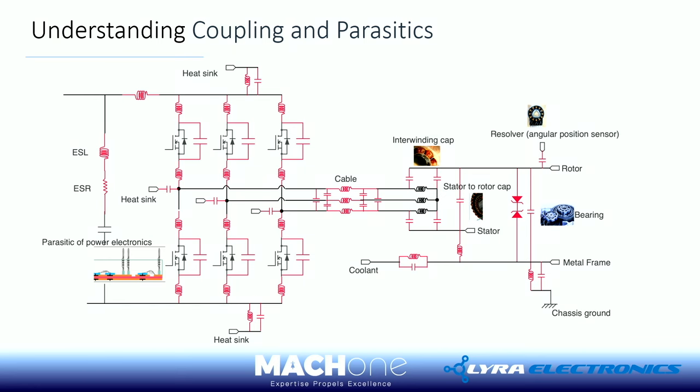However, as you said, if your chassis ground is bonded to a dirty or clean ground, whereas your motor drive is via heatsink bonded to another ground, and remember the conversation we had between these two grounds, you could have a gap or break or whatever in between. That's a high impedance path. So all of a sudden, you create a big loop with lots of noise there, and chances are the system will radiate a lot. And also, think about this dirty ground, as you pointed out.